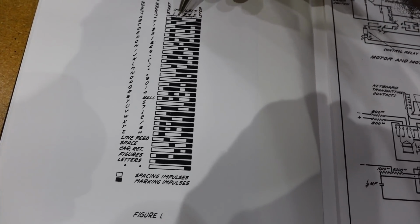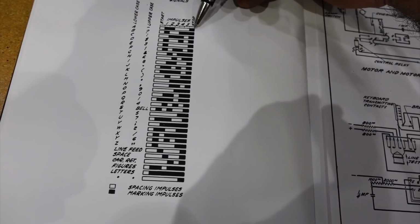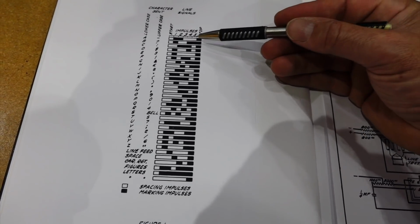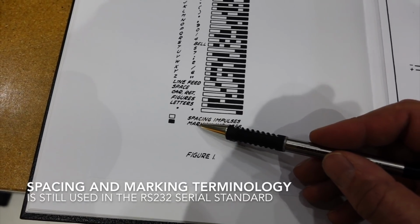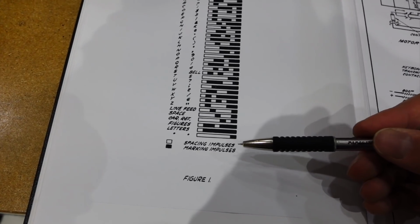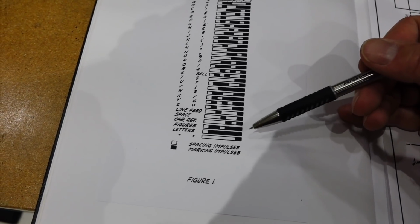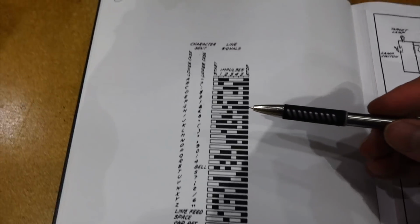So there's 2 that are closed, 3 that are open, and then you have 1 or 2 stop bits for teletype, at least 1.5 or 2, so they have the time to process the character mechanically. They don't call it on and off; they call it space and mark, which went all the way to RS-232, because it can be either on or off, or in one polarity or the other, in case you use polarized relay mode.